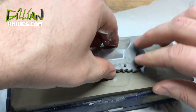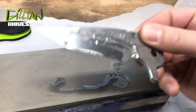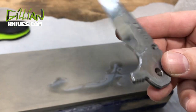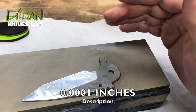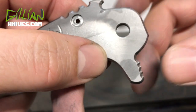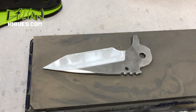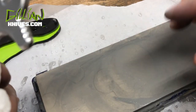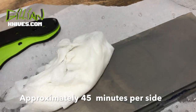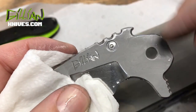I'm being very careful to stay off the bevels. What I'm doing now is lapping my blade — this is removing the small ripples left from the surface grinder's screw. Even though you can see them, you can't feel them, but they are there. I'm removing tenths — tenths of a thousandth, not thousandths. I'm watching this dark gray area close in. You're going to have a lot of water when you do this; I have a five-gallon bucket of clean water. Use plenty of towels, periodically dip your stone in the water — it just takes a lot of towels and patience. The dark grayness has reached the plunge line, so I'm now going to stop. I went ahead and did both sides; we've now flattened this.